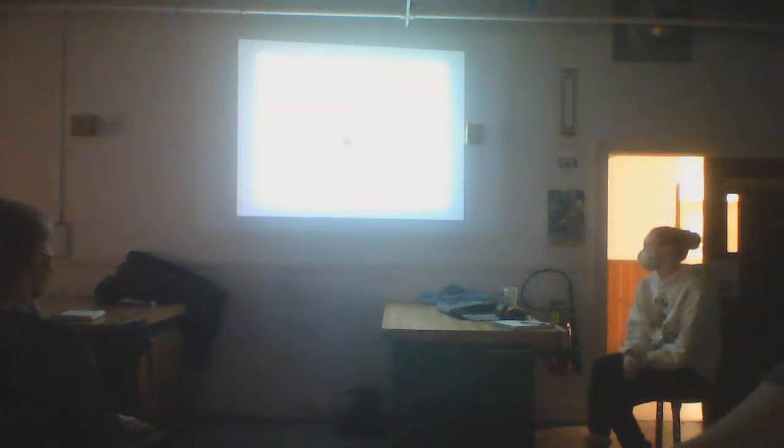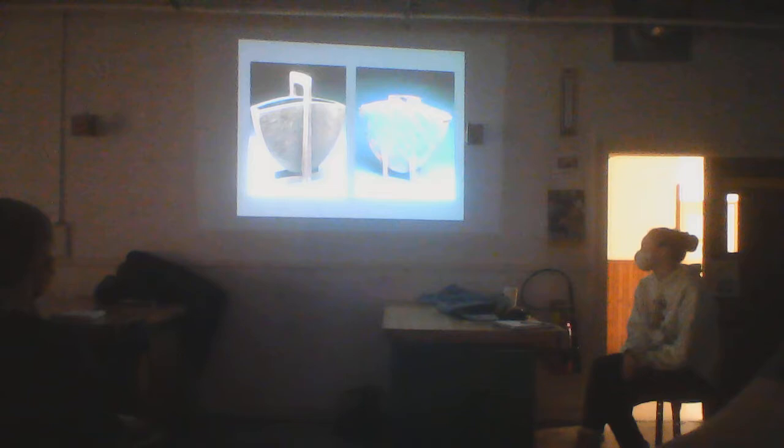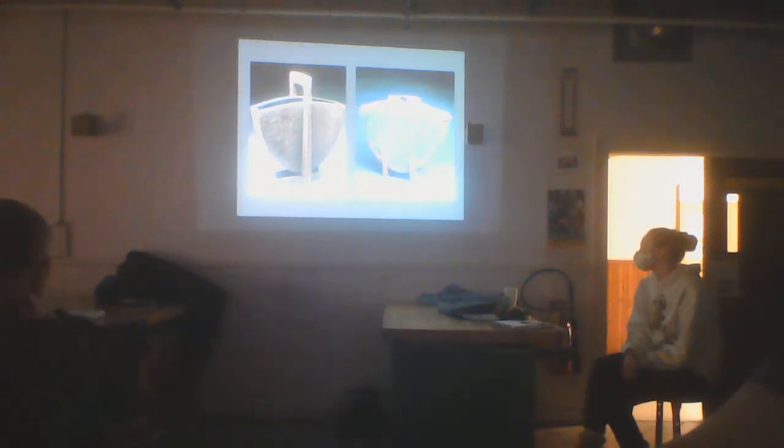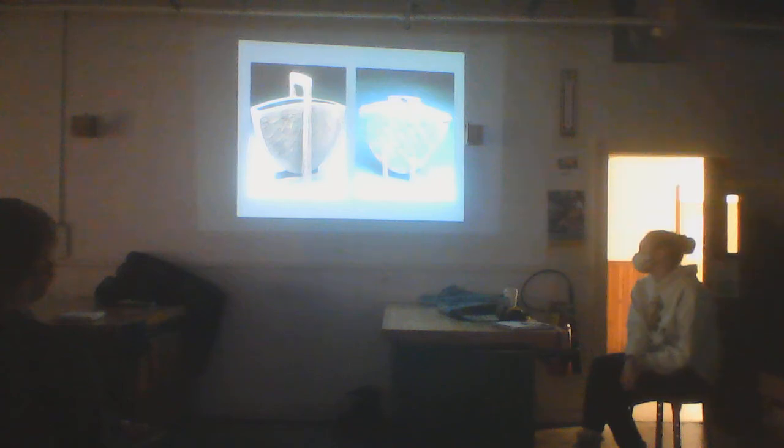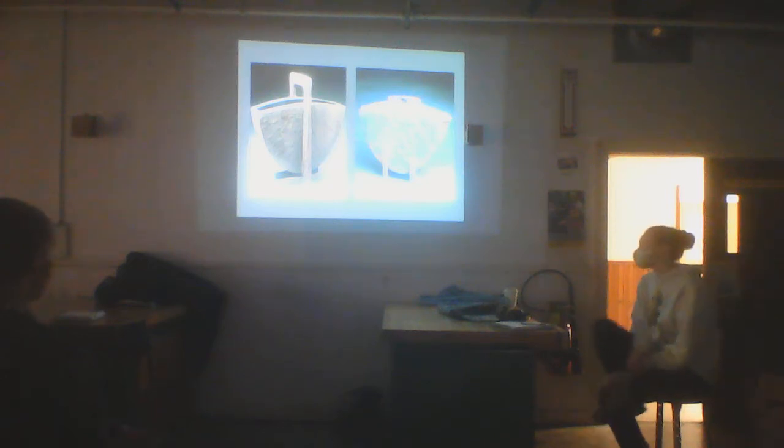But aren't they lovely? Just bright colors, playing with some iridescent interference colors. Ooh, yes. So these are the work of Michael Hurwitz, who is just an incredible woodworker. And the cool thing about these, apart from their handles, like the one on the left, the handle is definitely constructed separately, but that vessel form right in the middle, that was a bandsaw box. In this case, you cut off the sides, you cut out a big shape in the middle, you glue the sides back on, you cut out the outside shape, you do the shaping. So you can make these really interesting forms like that.